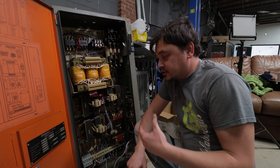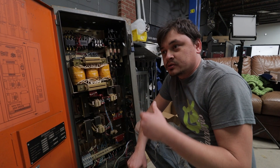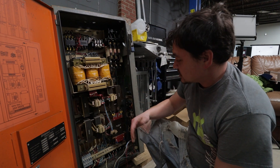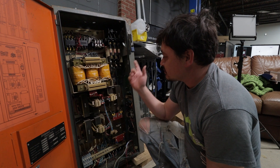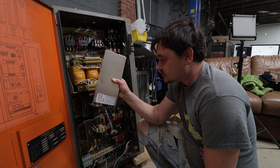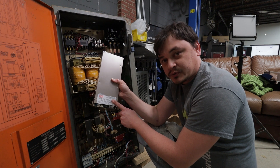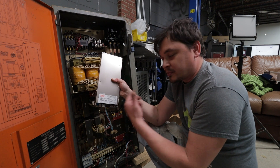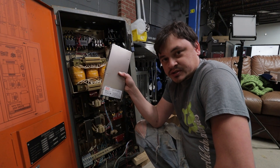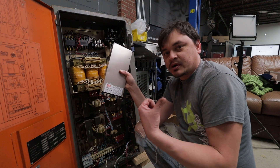This cabinet is where all the power was converted from what was coming out of the wall to what those other boards needed for operation - all these transformers change the voltage. All this is going to be replaced by this power supply, and maybe a couple other ones for different voltages. This one's 48 volts to power the steppers, and I'll probably have a 12-volt one for some other miscellaneous electronics, and then a reducer to bring it down to 5 volts to power the board.